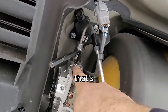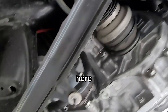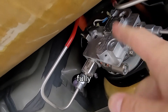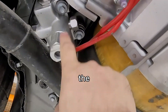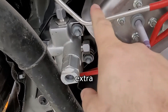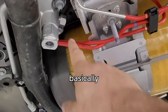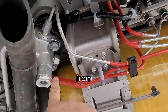The first step involves the manual valves — these need to be fully closed. There are three of these valves: one on each tank. One here, one on this side, and one on the front tank as well. All of these need to be fully closed. Once they're closed, you can proceed to the little knob and safely unscrew it to release the extra hydrogen stored in the system.